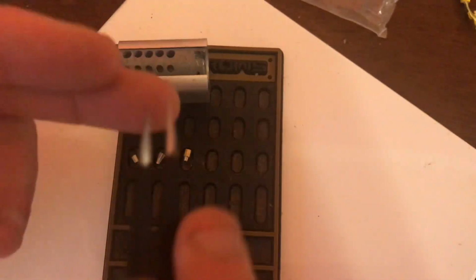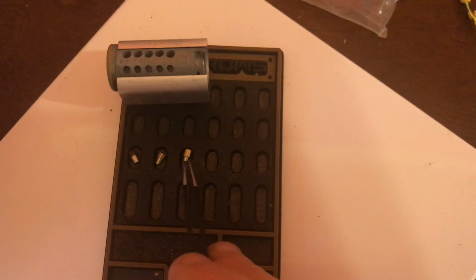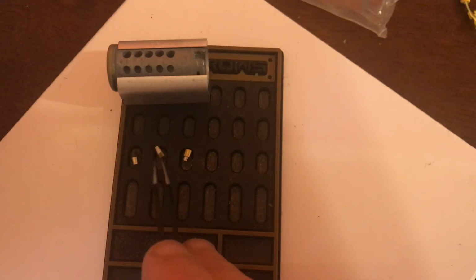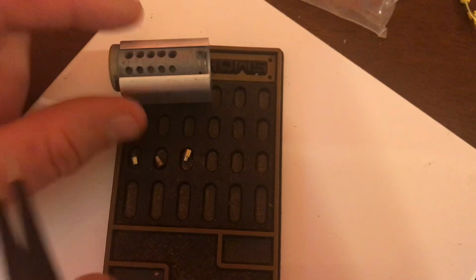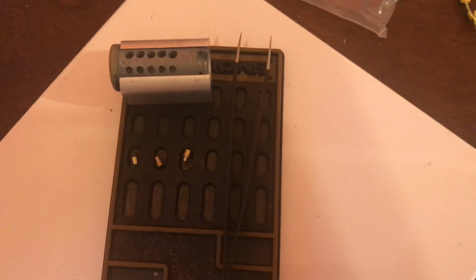But there you go. Just work that file on the tip of it as flat and level as you can. Check it every so often that it isn't coming out coned and rounded, and if it is, just go back and adjust and fill in your construction holes, and you will be making decent T-pins like a pro in no time at all.